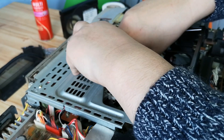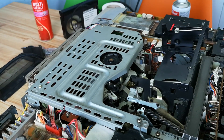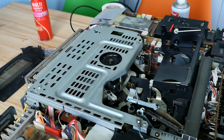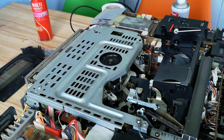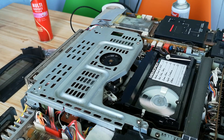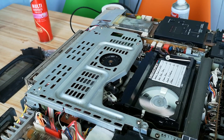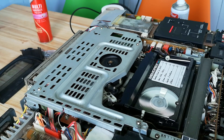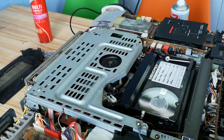Let's just give that another little clean and go fetch another cassette. I've returned with a number of cassettes — all of them claim to have wildlife films on them, so this will be interesting. I've got one here which looks like it's nicely rewound. Pop it in, let it lace, hit play — didn't like that very much. Head is still a bit wet. Let's fast forward it a tiny bit so we can hopefully get to a point where we have some footage.